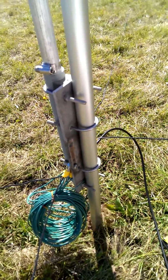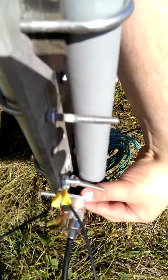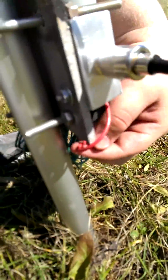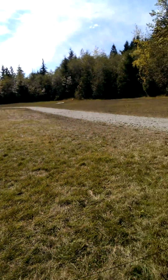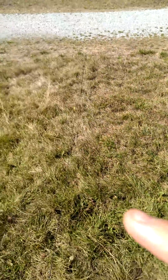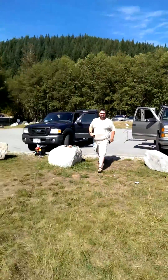I built these for 20 meters, and that's how I've got this configured now. If you go around to the side, you can see the feed point is very basic — just fed into a PL-259, or SO-239 I guess — and then it's just a chunk of wire to the base of the radiator. The radials just go out from the edges, as you can see.